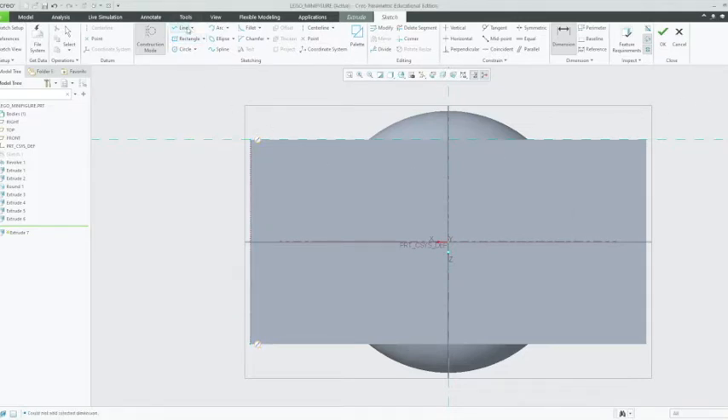Alright, so what we're going to do is — if the template we want is 14.12 by 7.8 on the inside of this rectangle, so this length will be 14.12 and this side will be 7.8 — then we need to come in by 1.38mm altogether. Not on either side, but altogether. So on either side, we need to come in by 0.69mm.